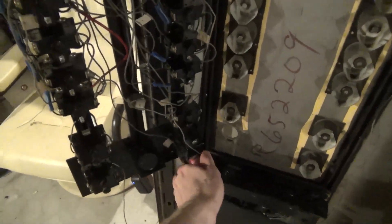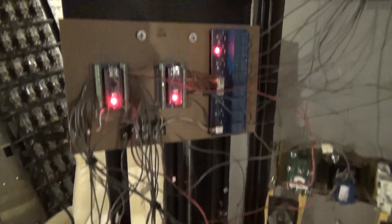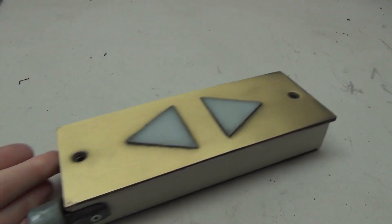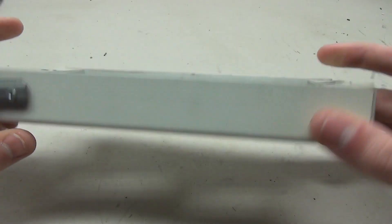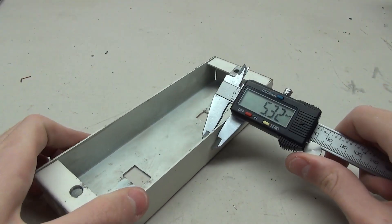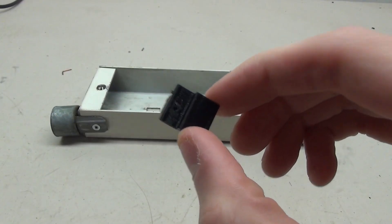At this point in the project, all of the hardware has been implemented except for the directional lantern. The directional lantern will need some custom parts, so I've got to travel back to my workspace to work on that. For this lantern, I'm going to be making some custom LED holders, and to do that I need to use my 3D printer. I first started by taking a few measurements of this box, and then using those measurements I created a small model file on my computer and 3D printed them. I made two of these, one for each arrow.